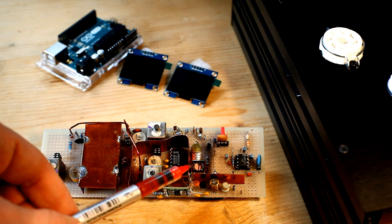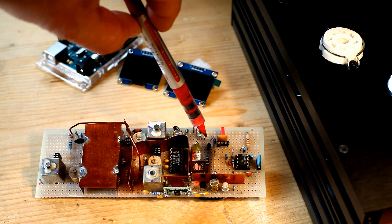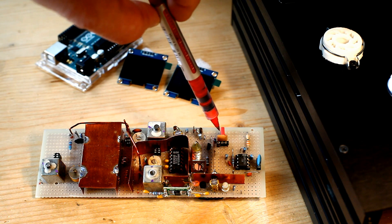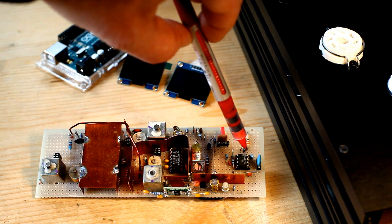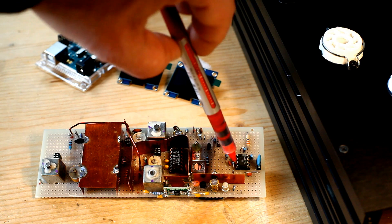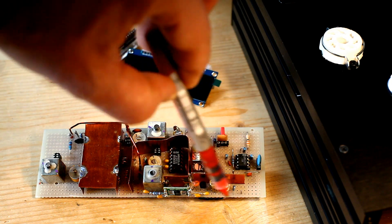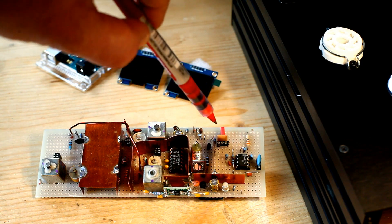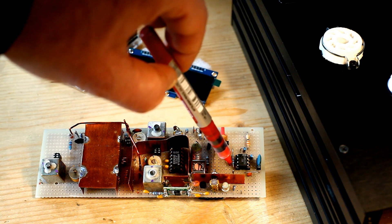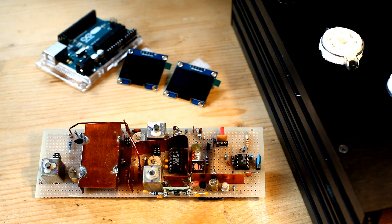The intermediate frequency 10.7 MHz signal is then fed into a first amplifier based on a field effect transistor. The signal is then filtered the first time, amplified a second time, filtered a second time, and amplified a third time. In the LA1222 integrated circuit by Sanyo, I have two gain stages and two amplifiers. At the end, my IF gain and filter stage provides three gain stages and two filter stages. I can then pick up my 10.7 MHz radio frequency signal and feed it into the next module, which will be the audio demodulator — I will speak about that in the next video.